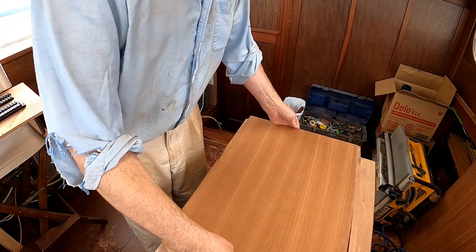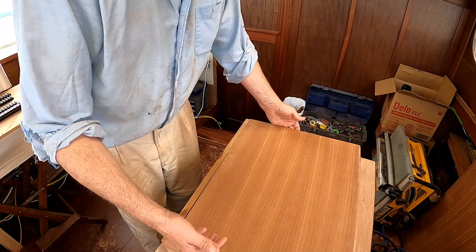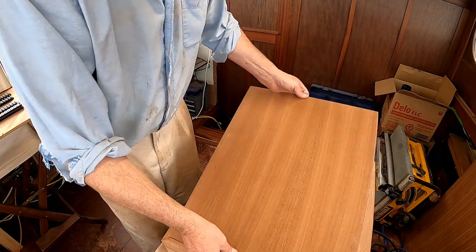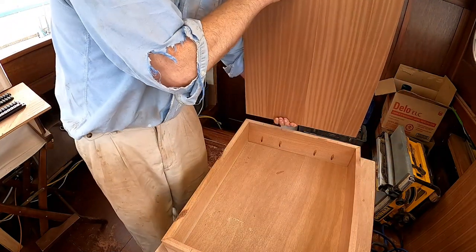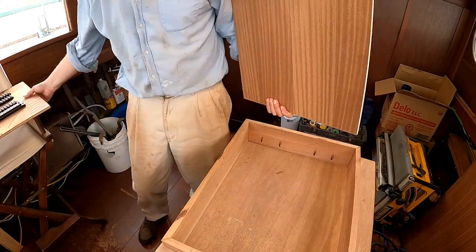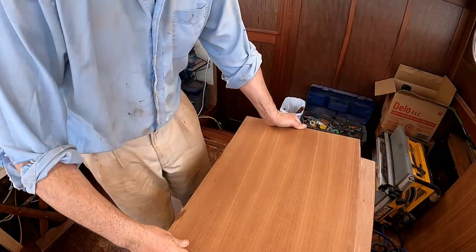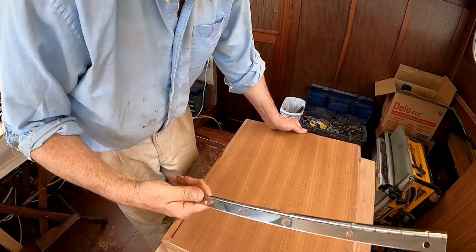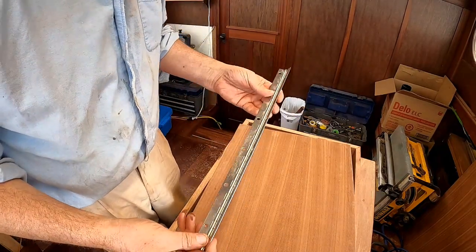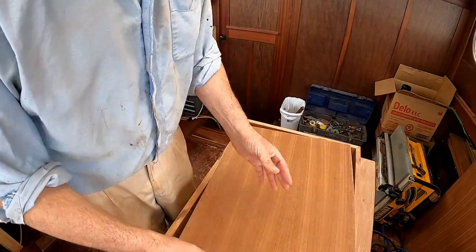Okay, so this is the front panel of the main electrical panel, and it's going to have all the breakers on it and switches and meters and stuff like that. But it needs to open up, let's do it this way for now, open up so that I have access to the back to make all the connections and inside where all these goodies will live. So that needs a hinge, obviously. And I'm going to use a piano hinge, as I often do. No more cheap brass colored tinfoil for me. This is a heavy duty stainless steel one. I don't mind that it's stainless down in there.